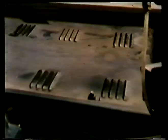These are the forms for the fascias of minicars. A sheet of acrylonitrile butadiene styrene, ABS for short, is drawn over the forms and clamped into position. The material here is only being used to form a decorative covering for the fascia. The sheet is heated by ceramic heaters to 160 degrees centigrade. Again, the forms are pierced with holes through which the air is withdrawn to create a vacuum. Difficult and intricate shapes in the form require more holes so that the polymer will form correctly.